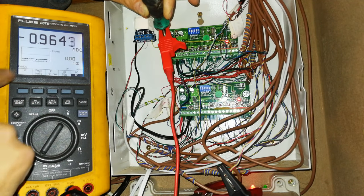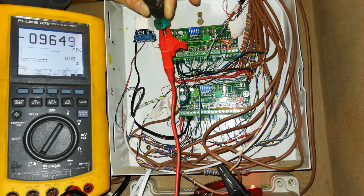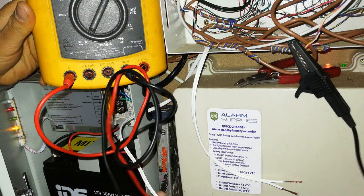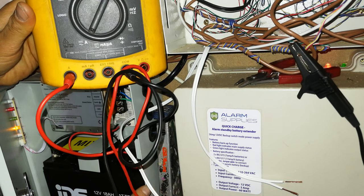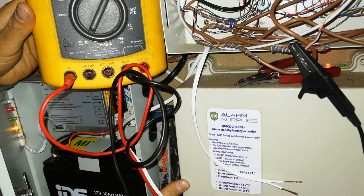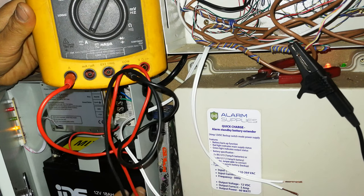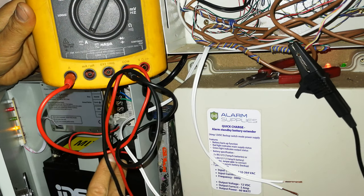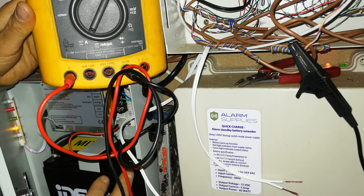So the key here is to divide that load. I've installed a second battery backup — also 18 amps — and I'll show it to you now. Here is the second backup power supply. Now I'm going to share the load. You saw it was one amp, so what I'm going to do is put maybe half an amp on one battery bank and half an amp on the other battery bank, giving me double the backup time. It actually works out to be a little bit more than double because of the nature of lead acid batteries and how they fail.